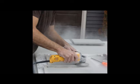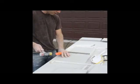Taking the forms apart, hammers and screwdrivers work well. Be very careful not to hit your concrete. It is very soft yet at this state; rigid, but it can dent and scratch easily or chip out a large piece.